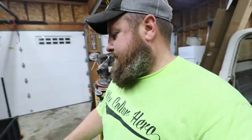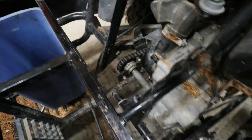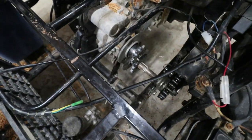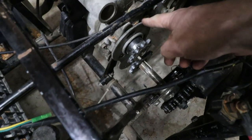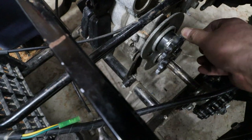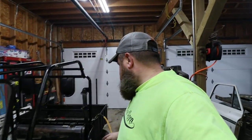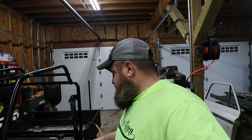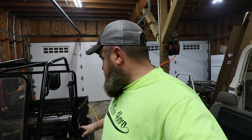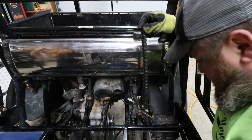We are going to put it together — had to wait for my son to leave. I want to surprise him. So far I have the output shafts on with chain drives on both sides. The bearings haven't been adjusted because the chain is still slack. I need to secure the mounting plate that swivels back to bring tension to the chains, and then I've got to cut the chain to length. I didn't do the link count, so I might come up a link short or long.